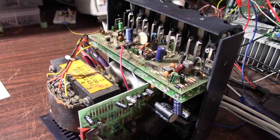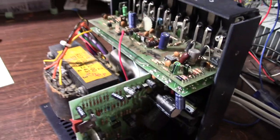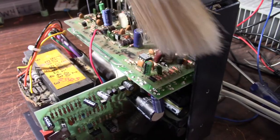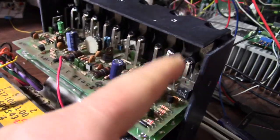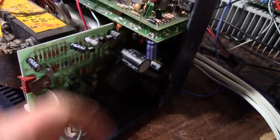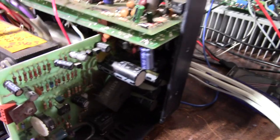The amp is now reassembled, all the caps are in, and I cleaned it up. I found an old paintbrush — those are good for getting the dust out without bending and stressing components. All the transistors are in, and I made sure to put the mica washers back in for the drivers. It's nice having that extendo mini tool kit to get down in there, because you have to put all these in with the boards plugged into one another — there's no way around it.